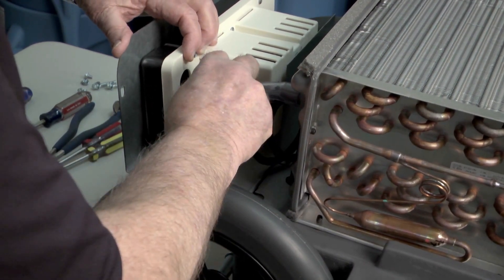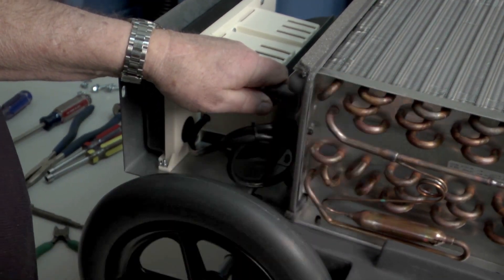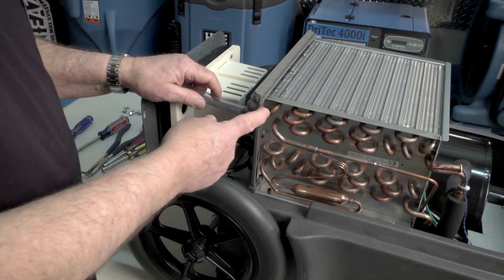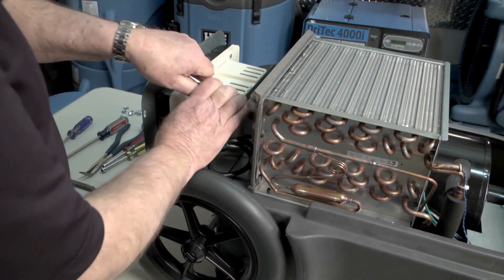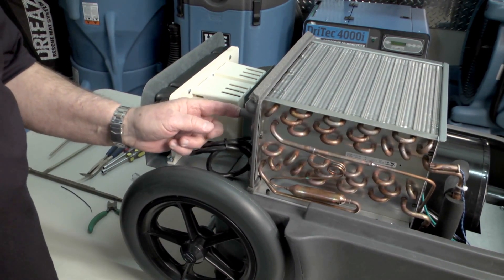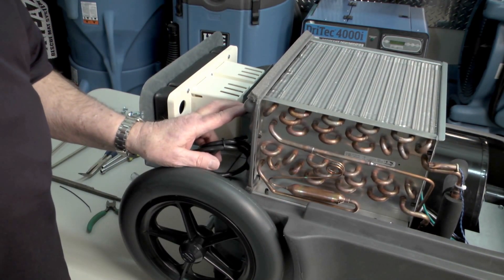It's also important to put this hose back in. One other thing: this is a drip tray underneath the coil. A lot of times if you're seeing moisture on the floor, it's because this drip tray is either plugged up or partially plugged. You can pull this hose off, take a blunt object and push it back up into the drip tray, and also flush it out with a spray bottle, making sure you get all the dust and lint out of there.